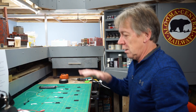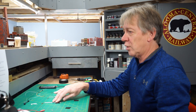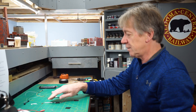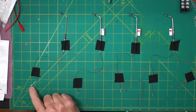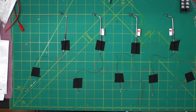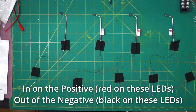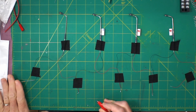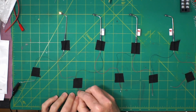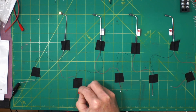I've set up four of my street lights that I bought online - 20 lights for $16, so 80 cents each, and the resistors are three cents a piece. I've soldered one resistor to the negative lead of the first LED. With DC power, you can think of it that power comes in on the red and back out through the black - both need to be connected to the power supply. I've hooked the negative up to the resistor and if I hook up the positive to the first LED, the LED comes on - running with just a single 510 ohm resistor on the negative side.